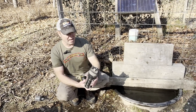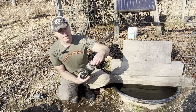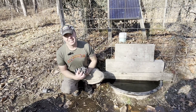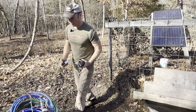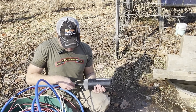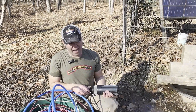That's probably why our pump has lasted nine years. When you hook it up, you have this barbed flange that's sticking out of the top — that's where you put your water pipe. This is just the right size for your half-inch PEX pipe. An internal diameter half-inch pipe will fit right over this, and then you can go ahead and put a hose clamp on it. Then you have your electronic connection. Your electrical connection has a positive and a negative DC power — you simply plug that in. Whenever you get your pump in the mail, it's going to come with a boot like this that slides over your electrical connection. You simply plug it in, and then you slide the boot over the top of a smaller rubber boot over your connection and tighten that down. That's going to give you a water-tight seal so that those electrical connections will not have any water infiltration.